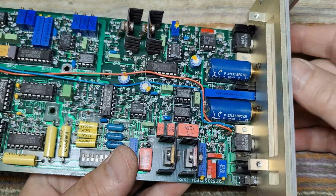And there's also another little detail here at the front. So they go real nice and fine here, right? But if you take a screwdriver and turn this screw here a little bit, then this little piece of aluminium here moves to the side, and it kind of locks the position. Now you can't turn it. Isn't that just lovely?